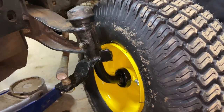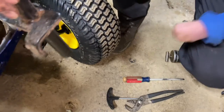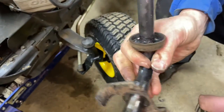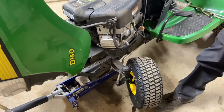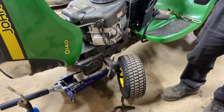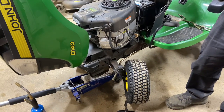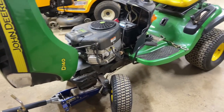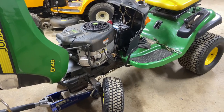That pretty much sums up how to install this. This is a very common problem with the John Deere — and that's from lack of lubrication. So remind yourself that these machines have to be greased in the front because they do have the bushings. I do have a video on how to remove the bushings on the wheels and go to roller bearings — it's a kit that I have, and I'll have it in the link in the description below. As always, if you like this video, please give it a thumbs up, subscribe, tell your friends about my channel. If you have any comments or questions, please leave them below, and I'll catch you on the next one.